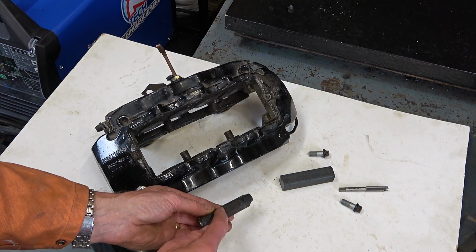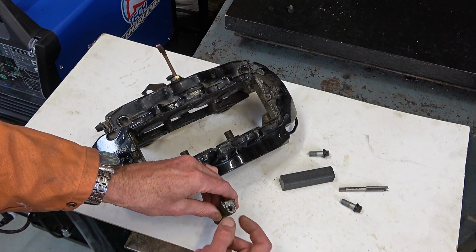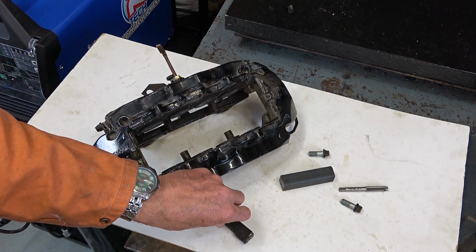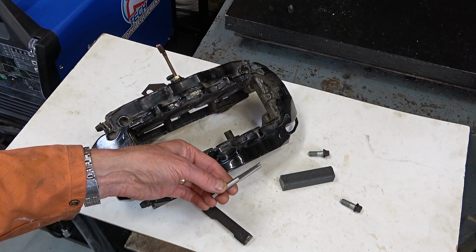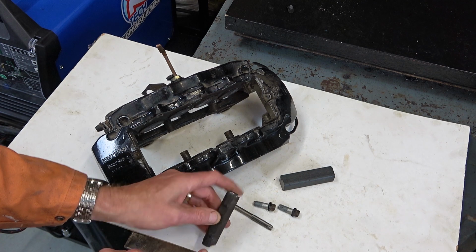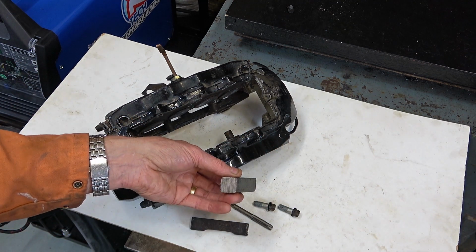This part is a relief for the disc, and I think this taper part here provides a relief for the brake pads as they go in there. It's also, this thread, quite an odd size, 9mm by a pitch of 1mm. He's given me a couple of screws to work with. The other 2 screws are missing and he'll have to source those for himself. So I think the first thing I'm going to do is to drill the holes in this piece and tap them 9 by 1.